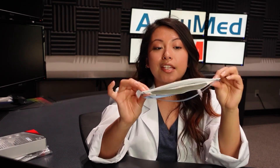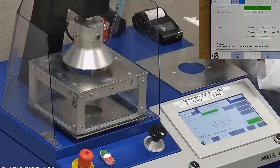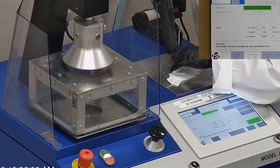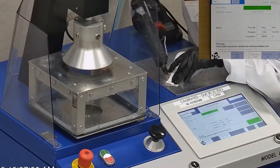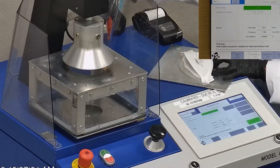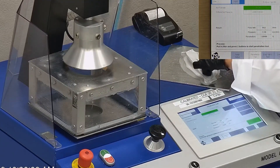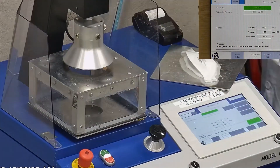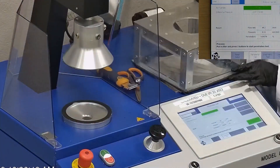Let's go ahead and see how these perform with our TSI machine and see if they pass the filtration test along with the breathability. This is our TSI machine. We use it to test the particle filtration efficiency of a respirator or mask. Our testing procedure is inspired by NIOSH. We first remove the band of the respirator before placing it onto the testing plate to ensure a proper seal, then we make sure that the respirator is completely sealed with hot glue to the testing plate. The testing plate is then attached to the frame and the box is placed under the TSI filter holder for testing.